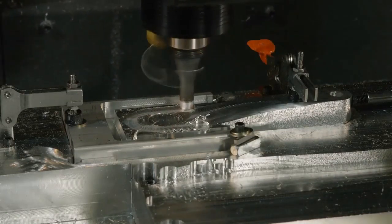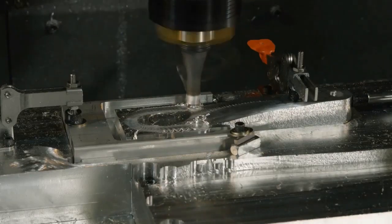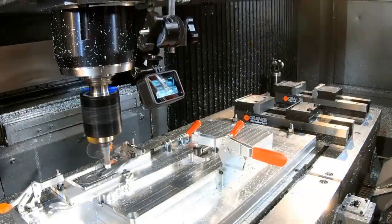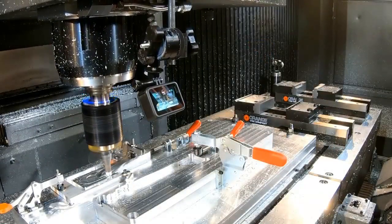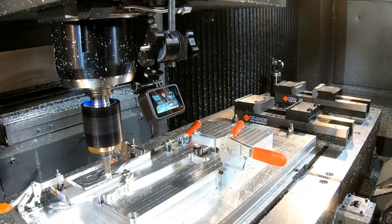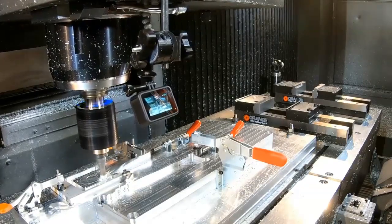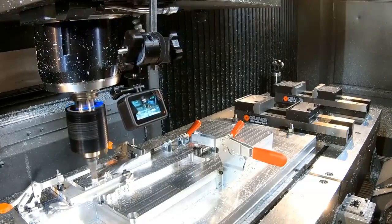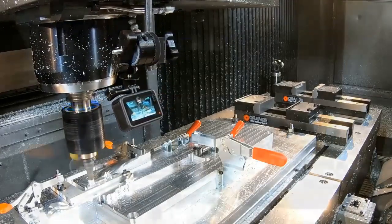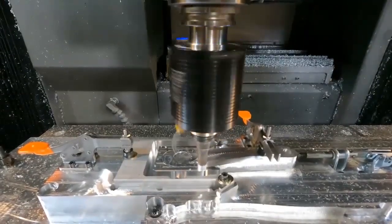There's a thermocouple that goes into this tool and we're recording the tool temperature in real time. We're also monitoring load — the downward force of this process — in real time, and we're broadcasting it through Bluetooth in our intelligent tool holder to the Smooth G control. Here we control to a specific load and a specific temperature so that we get the same weld and weld properties every time, taking a lot of the guesswork and art out of the welding process.